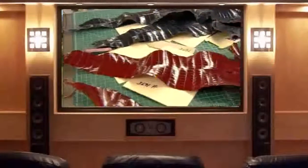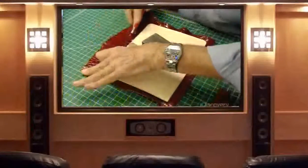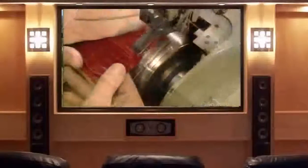This red skin is from the Nile alligator. The cutter maintains the pattern in place with a weight and cuts out the shape of the bag, leaving a border called a turning-in all along the pattern. A skiving machine then delicately shaves the back of the alligator skin to make it thin and pliable.